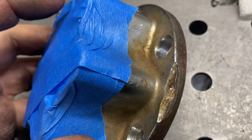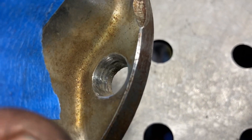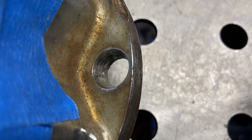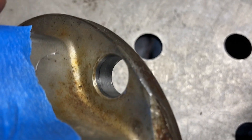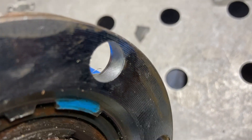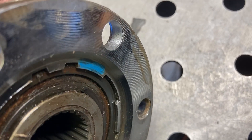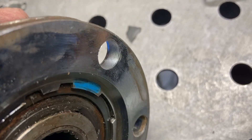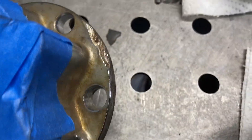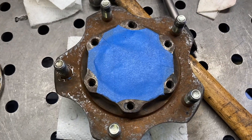The reason we go to 7/16ths instead of 10mm: 7/16ths is basically how big you've got to go to clear out this taper. I've drilled this hole here - this is one of the original holes, it's tapered for those cone washers on the bolts, and by going to 7/16ths it drills out about 90% of that taper so it's just a straight hole. I just drill these to 7/16ths - it's pretty snug on those fine thread cap screws. I've masked this all off to keep any shavings out.